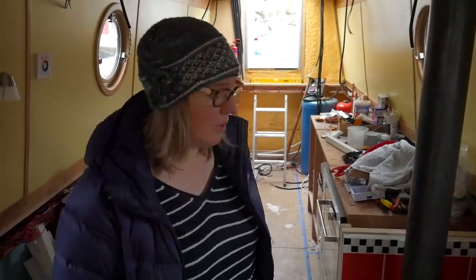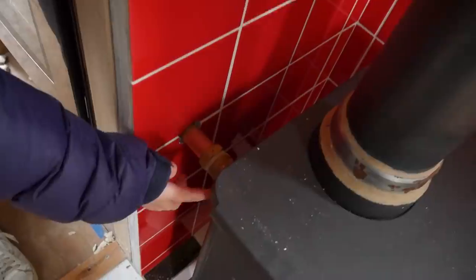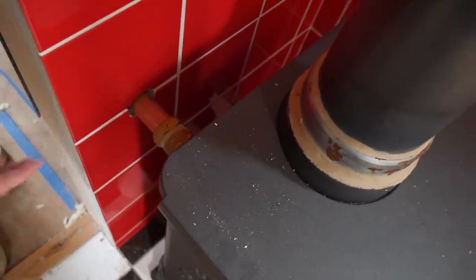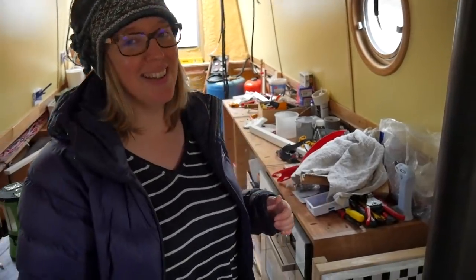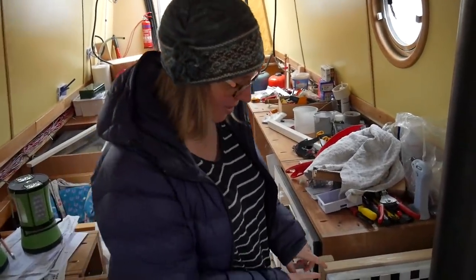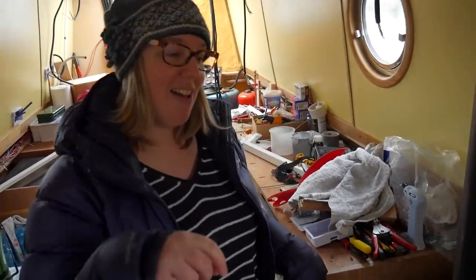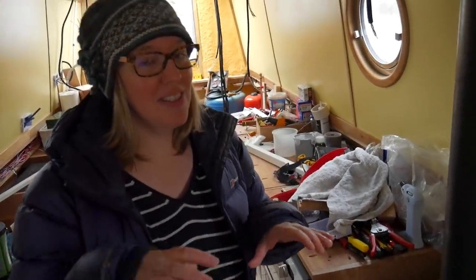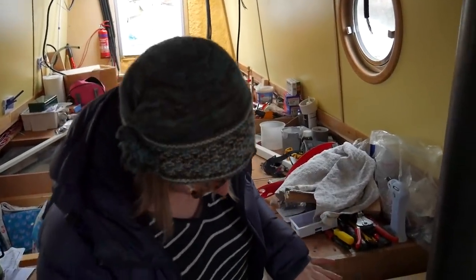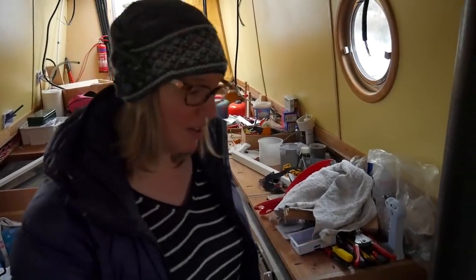Plumbing in the back boiler was a pain. We had to cut holes in here, and cutting that kind of hole in tile is not the easiest thing in the world. We had to put holes in the calcium silicate board, line the tiles up and then cut holes separately, and very carefully get all of the placement exactly right for the tiles. It was a bit stressful.